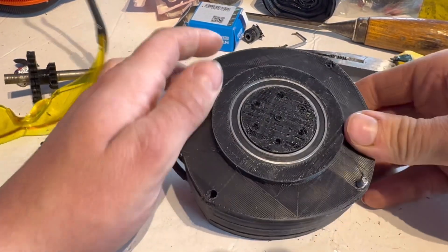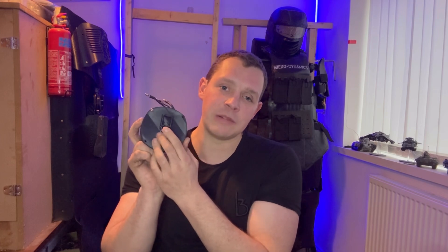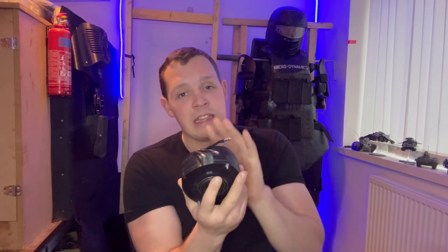Having completed the stator trials, I fitted them into my actuator design for a complete 3D printed prototype to see how everything fit together. You may be wondering why I'm not showing the actuator working yet - well, it doesn't work yet. It's most likely because I'm trying to run it with a regular brushless motor ESC, which calibrates on startup and relies on a back EMF signal to determine phase positions. I don't think that's matching up on these stators, most likely due to my imperfect design. There are two ways to fix it: go back and design a stator that matches the expected back EMF using actual design software, or use a diametric magnet on the back with a hall effect sensor to create a sensored ESC - which I'll also need for position sensing anyway as a robotic actuator.